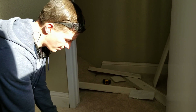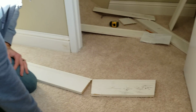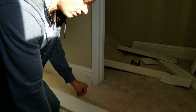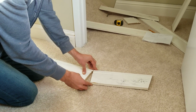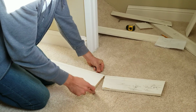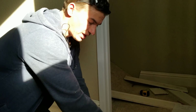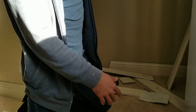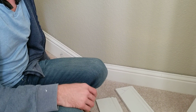We're not doing 180, we're doing 150. The difference is 30. And so 30 degrees needs to be split up between these two. So 30 divided by 2 is 15. So this one's going to be cut not at 0, right? But at 15, both this one and this one. And when we cut both of them at 15 degrees away from the 0 point, they add up to 150. Because we subtracted 15 degrees on both. So they add up to 150. Right here, I cut them both on 15 degrees less. They added up to 150 instead of 180.